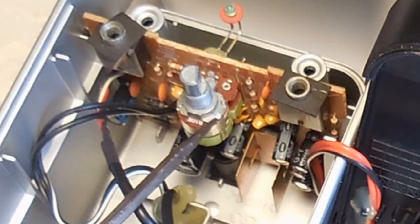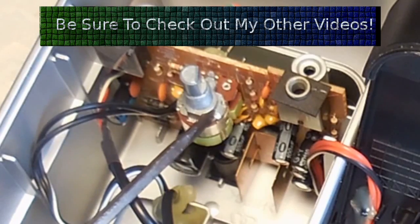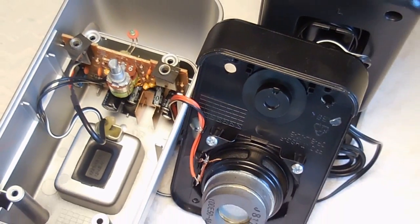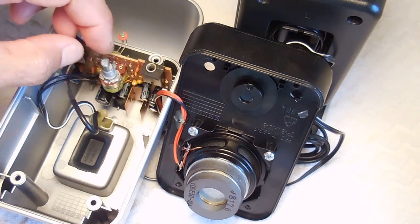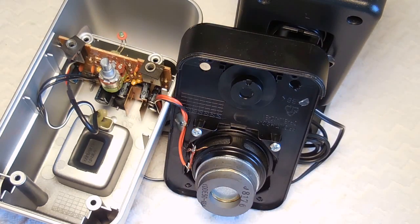You could do all four — you don't have to do it that much. Do one side a little and the other side until they're sticking up straight, and then you could tip it and pull it right out of the housing. Once it's out of the housing, you can take the electrical contact cleaner, clean the contacts, move the wiper back and forth by rotating the knob, and reinstall it.